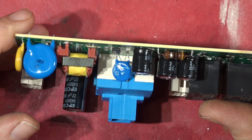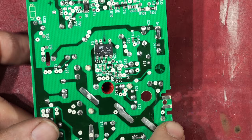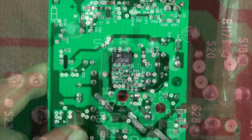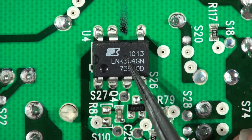On the back of here we've got a control chip - and I can instantly see a stain just here. Can you see that where it's blown? The magic smoke has been released in a puff and taken out some debris with it. Let's zoom in on that. There's the actual chip and we don't really need to look any further, because this is clearly blown - you can see there's a little crater or fissure on the top with a little bit of stuff that's come out.